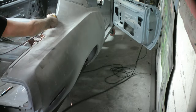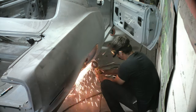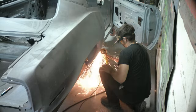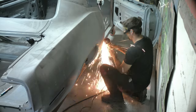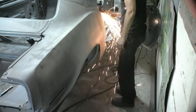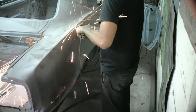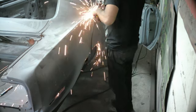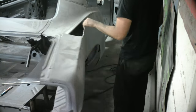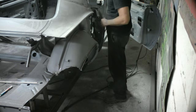At this point we decided to move on to the other side and take a look at the inner structure. I had to order parts for some other stuff I was missing, so I decided to cut the quarter panels off on this side and see what surprises await. Of course, like most of these cars, it was way worse than we thought. I don't know if Mopar used any kind of primer underneath these cars, but apparently this one missed that day - because everything on the inner structure seemed like it was rotted away. This side needed not only the frame pieces replaced but also some of the support pieces behind the skins. So we got the quarter panel off, got the parts ordered, and will pick it back up whenever they come in.